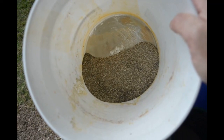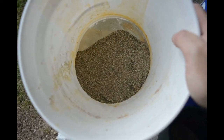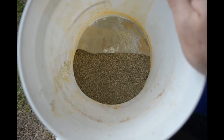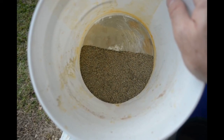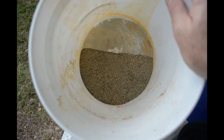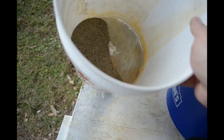What I want to do is treat this stuff with nitric acid to dissolve out all of the metals, and then treat it with aqua regia to dissolve out the gold. The problem is 95% of the bulk of this is the sandy material left over from grinding up the silicon dies. It's just in the way. It makes it difficult to get the acid solutions in contact with the metal, difficult to leach out all of the base metal salts after the nitric acid treatment, and difficult to get all of the pregnant aqua regia solution out of it.